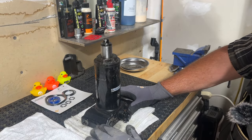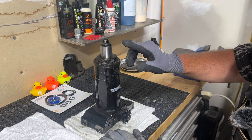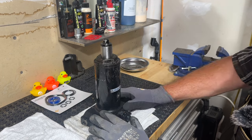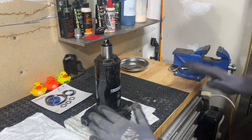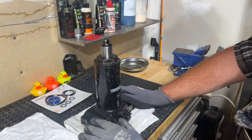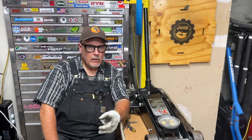This cast block has pathways through it for the oil and other mechanisms. This tube is separate from this nut, and this nut needs to come off. Taking it off is very difficult because at the factory they torque these on very hard. I had to take it up to my friend's house to get it loosened — he's got big pipe wrenches and a large Craftsman vise. My little Harbor Freight vise is fine for bicycle parts but couldn't handle this. Let's take a look at how we loosened this cap.